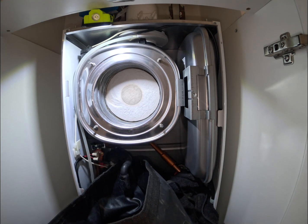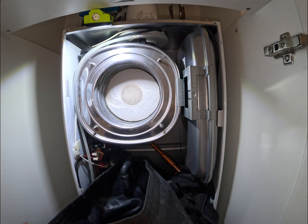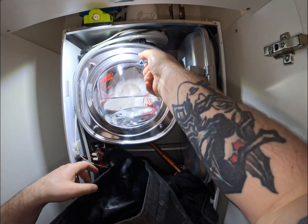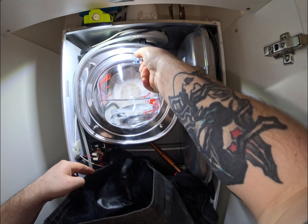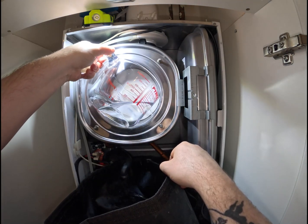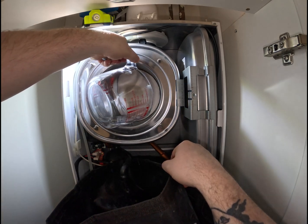Obviously before we do that, make sure we cover the PCB. And that design flaw on all boilers — why put the electrics at the bottom where if there is a leak, the water runs down and into the electrics? Maybe someone can tell me why, but that's the way it's done, so you've just got to be careful. Keep a few towels in the van. There's a thing called a boiler PCB cover I saw online — it looks pretty good but I couldn't find it, so if anyone knows let me know. So just some warm water, pour it down, make sure that's nice and clean. As you can see, I've removed the condense trap so all that dark rubbish isn't going into it.